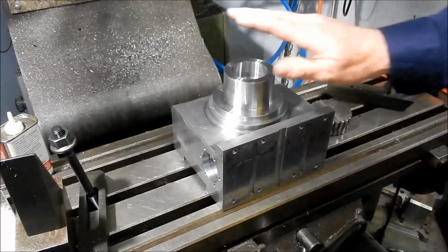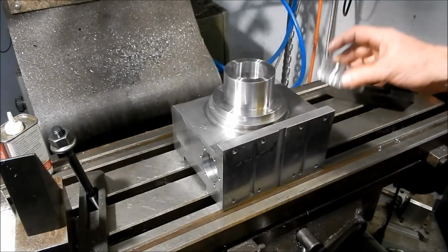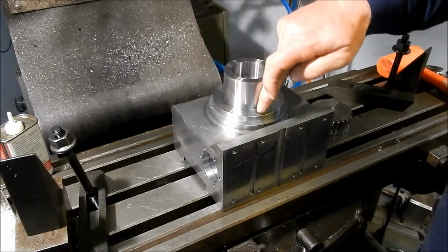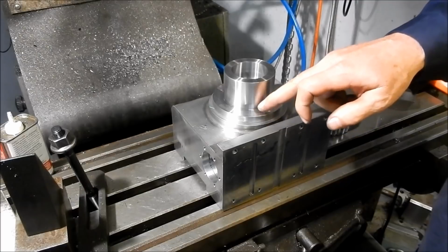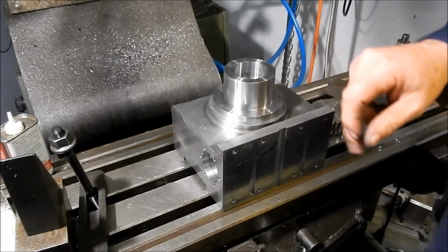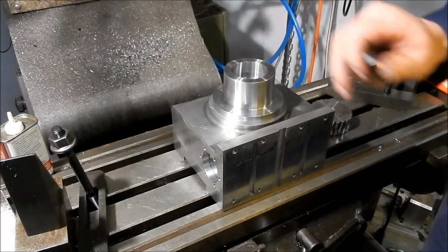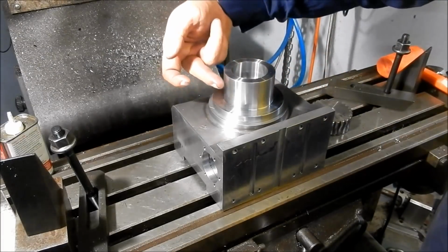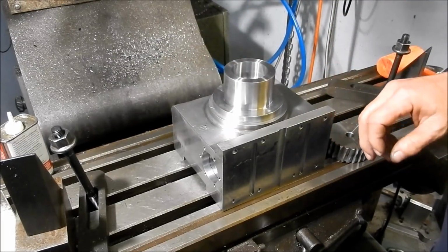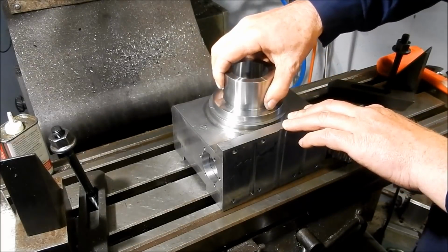She's home. So that's the housing for our worm wheel that we're going to be popping in there. And we're going to do the drilling and tapping to match up with our drill and tap in our compensating ring here to position this. As I said, with that little blue that I made, I'll just have to make sure I get the orientation right compared to these, and also the slot we've got to pop in for the anchor arm for the motor adjust.